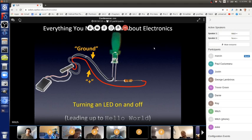The microcontroller does its thing to run programs and control pins with parts connected to them. The other circle is the power supply through the microcontroller, through pin 13, through the LED and resistor, back to the ground of the power supply and around that way. Two totally separate circles that are related. Two circuits. So we can have lots of them, because each output pin, or an input pin later, can be its own circuit, all controlled by our controlling program in the microcontroller.